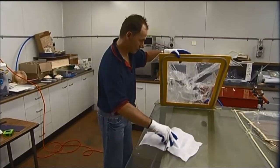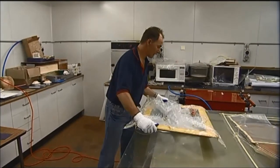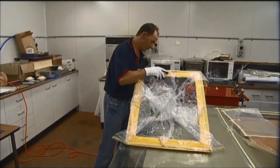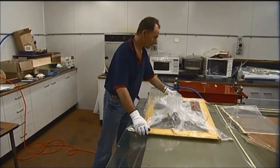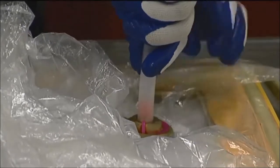Consolidation can be achieved by applying a vacuum under an airtight bag. The top surface of the laminate is initially covered with a perforated or porous release film and a breather cloth, used as an avenue to supply an even vacuum to the whole part. The vacuum pressure not only forces the layers together, but also assists in the removal of trapped air.